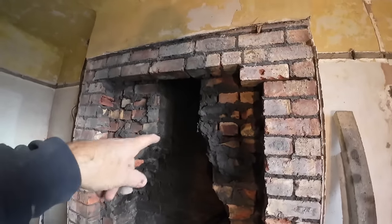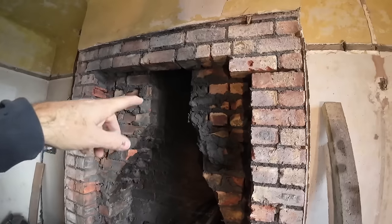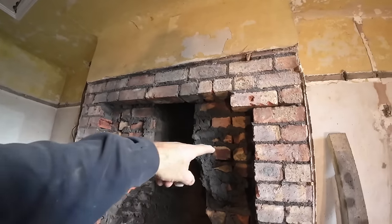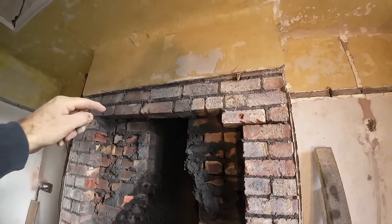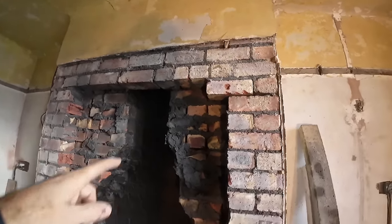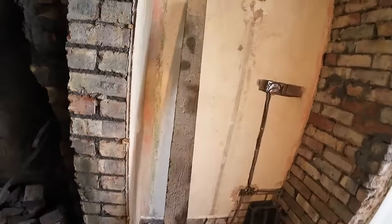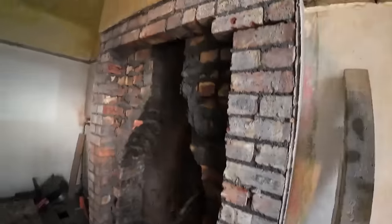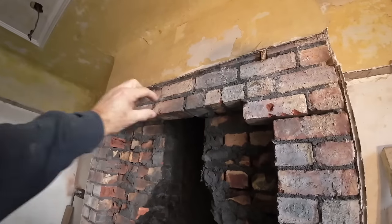And then this has been swept, I think yesterday or the day before, although it's still very rotten. But we've still got to support all this masonry that goes above. So we need to basically slot two more lintels in for each skin. So we've brought three, and the customer has one anyway, which is a 1500, so at least you've got the right size. But anyway, so we've got to cut that out.